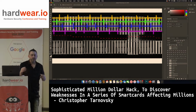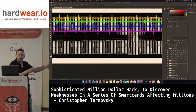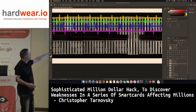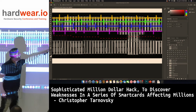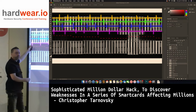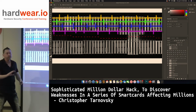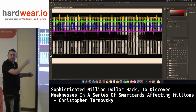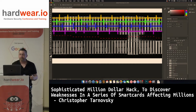So what I would do is I'd go from here to here. And that's enough room for me to open those 8 holes, 7, 8 holes. So I go from here to here and I jump it. So I'd say, okay, I know based on where I am in the chip that shield wire 56 connects up over here to number 20. So I just make a bridge across, I drop platinum or tungsten across this entire distance away from my FIB edit area, somewhere in the chip, just away from where I'm going to do my actual edits. And once I do these 4 bridges, I can open a hole anywhere in this area I want to. And the chip has no clue.